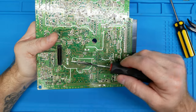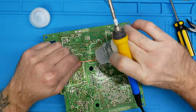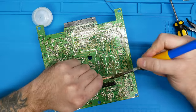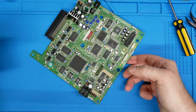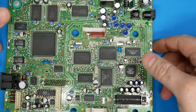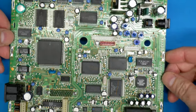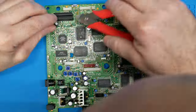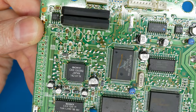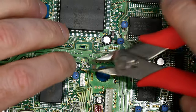Now you can see all these points on the back to desolder to get that secondary smaller shield off. Here you can see it just fell right off once all the solder was removed from those pads. There's a close-up of the board — there's a large mix of surface-mount style and through-hole electrolytic capacitors. Not fun. I went ahead and snipped all the capacitors off, even the through-hole ones. You can see I had quite a bit of leakage and corrosion, and this was a pain to clean up later.